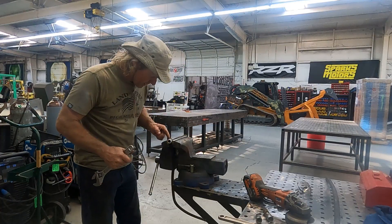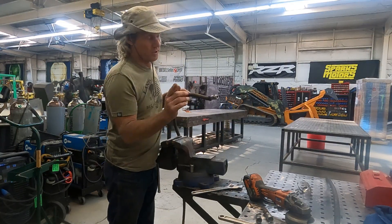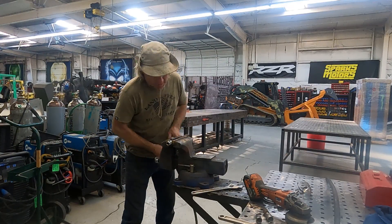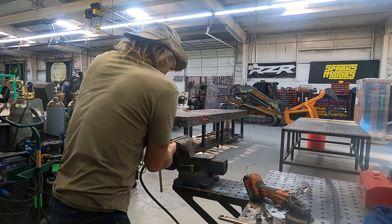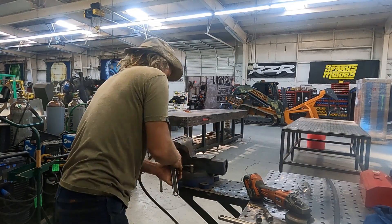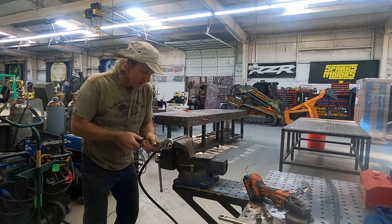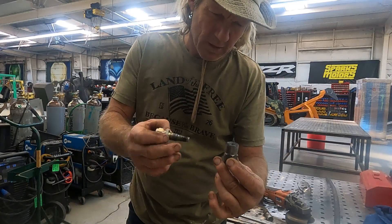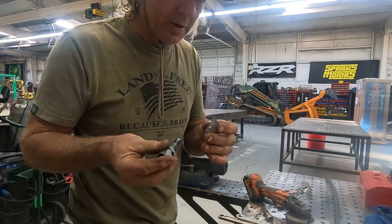Now this part — as if things weren't getting harder — my hydraulic hose, which looked like it was in good shape, is just breaking apart on me. So it's going to make it a little bit harder to get out of here. I'm going to have to crimp this thing right up to there and try to twist it off. Now it should thread off, but when they get really old I've had to pull them off. Sometimes you have to pry on it. It's got bits of the old hose in there — I'll need to clean this thing out.